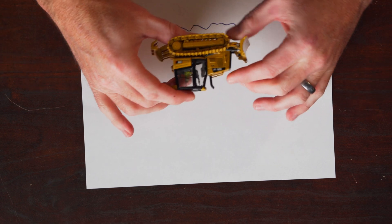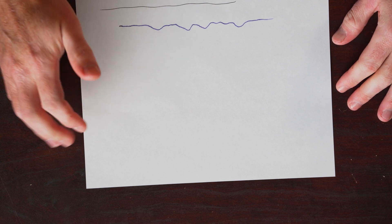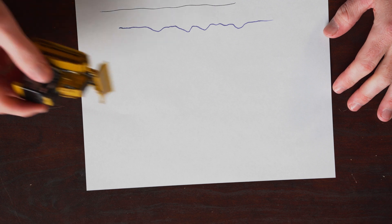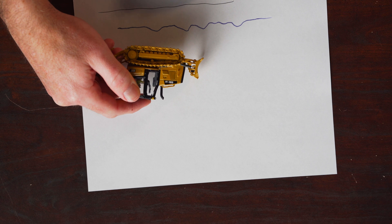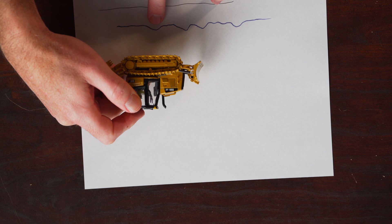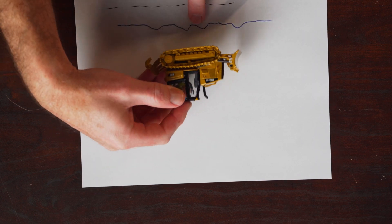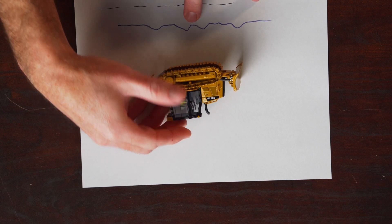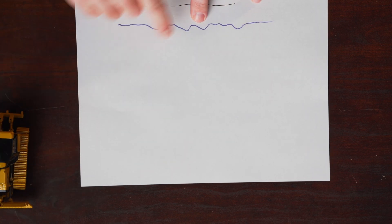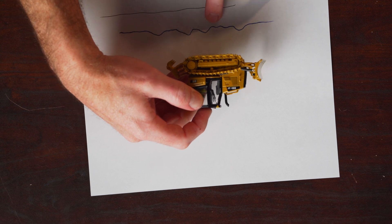As a really good operator you can gauge the feedback and be adjusting on the fly with your blade, and this will come out the back of the dozer as a relatively smooth pass. As a rookie, this is going to really send you for a whirl because your hands aren't used to keeping up. Now, why does the track base make a difference? With this short track base, as I'm coming along the dozer is going to lift up, and once I get to the teetering point right in the middle I'm going to slam back down — we're past the pivot point. My dozer starts pitching down and I have to compensate with the blade. But if my track base spans two little hoopties, I'm not going to dip so much — I'll hit that second hoopty and actually kind of level out until I get past it.